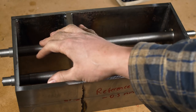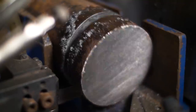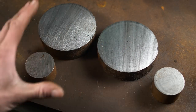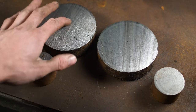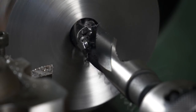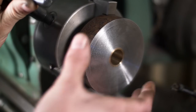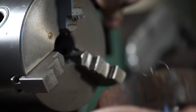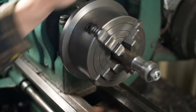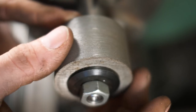This is the clay mixing area and this is going to be a gearbox, so I guess we need some gears. These are blanks that are going to be made into gears. I'm going to mount these in a chuck and bore them out, then install these on an arbor. Some of the gears are able to free spin and these have bronze bushings pushed into them. Using this arbor lets me turn the entire outside diameter down to the right size for gear cutting.